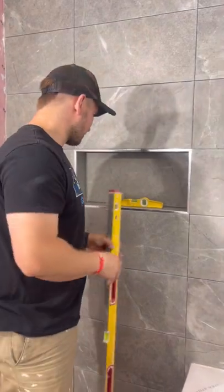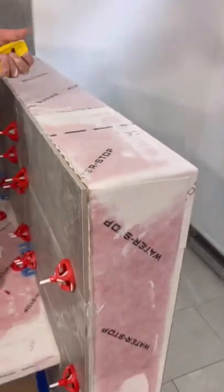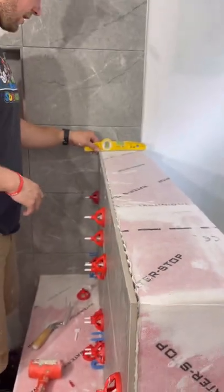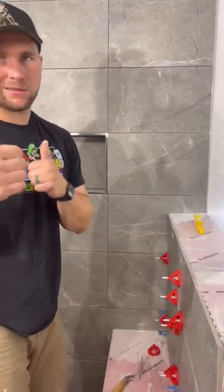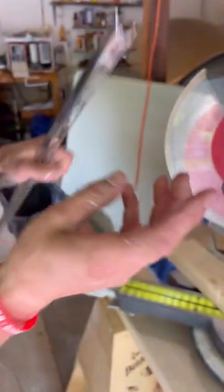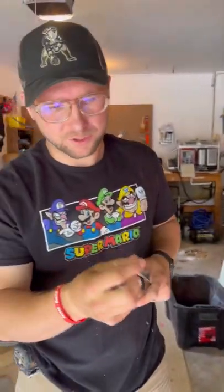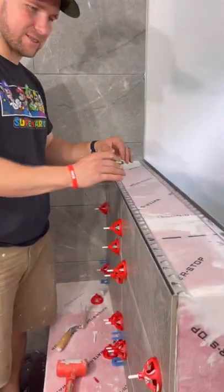What we're going to be doing is get a piece of schluter strip this way and this way. I do have a nice pitch on this right now, so I'm happy with that. All I have to do is cut a piece of schluter strip from here to here, here to there, and then down. The trick to getting extremely sharp cuts is using the right blade. We have the Diablo blade — I'll link it down below. It's much, much cleaner than doing it with your tile saw, which kind of ruins your tile blade, so don't do it with your tile saw.